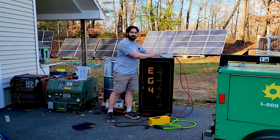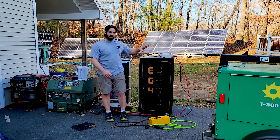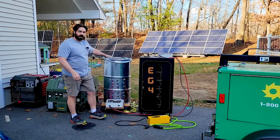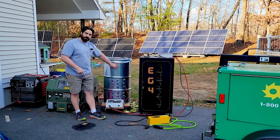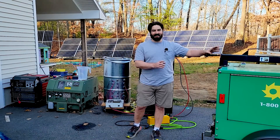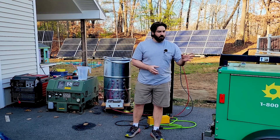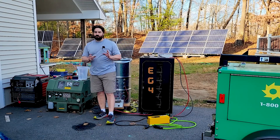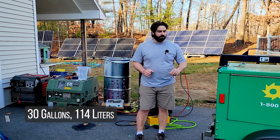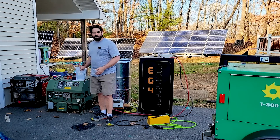Connected to the charge inverter I have a Victron smart shunt in this little plastic box, measuring the electricity right before it goes into the battery bank. We're going to connect that up to the 240 volts of the generator. In case the battery bank starts getting full, I have a dump load — a 55-gallon drum full of water with a bunch of heating elements — to keep the battery bank at a consistent voltage throughout the test. The light tower has an onboard 30-gallon fuel tank, but instead of marking it and refilling, I've taken the fuel hoses off and connected them to a big measuring cup for better accuracy.